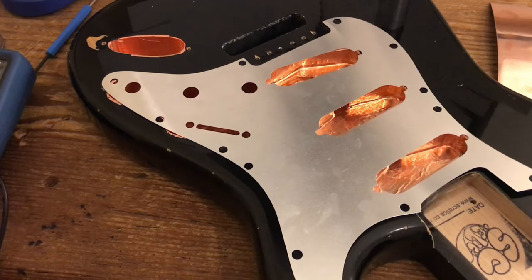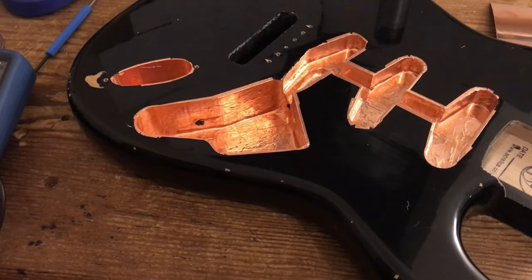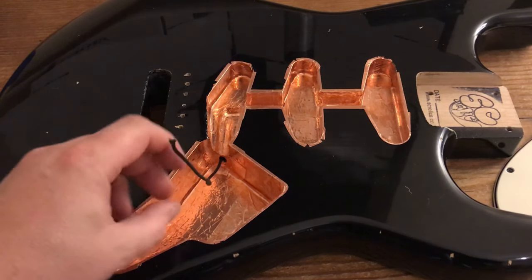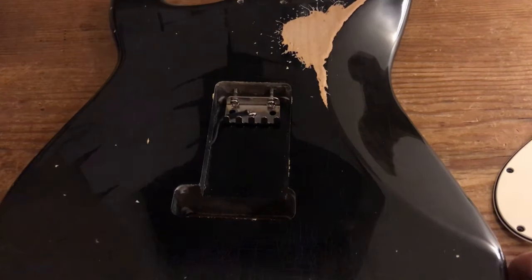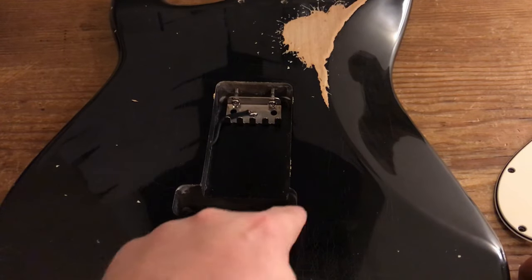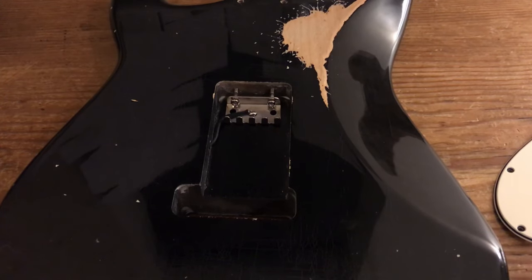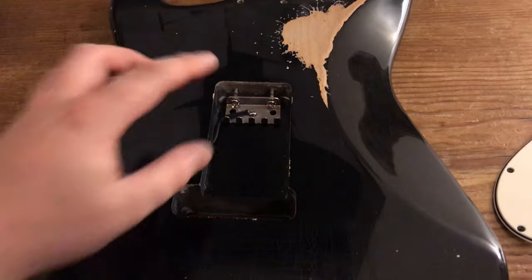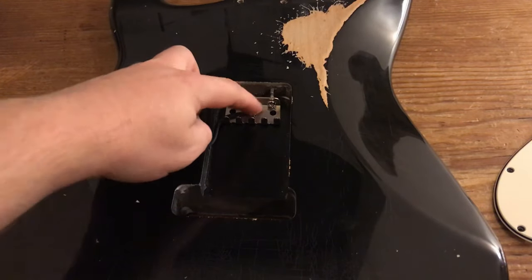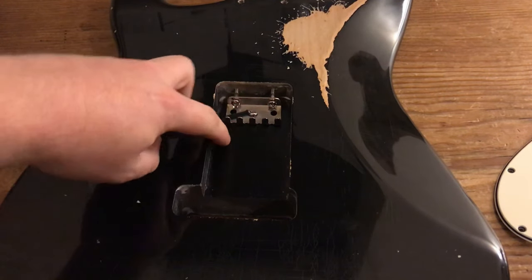That's how you create the Faraday cage. However, your Faraday cage is completely useless unless it's grounded. I've put in the ground wire coming from the trem claw on the back. When this is grounded and connected to the springs, the bridge, the trem system, and therefore the strings — which we as the player touch — that's part of the ground circuit. This is what you'll see on a lot of diagrams as 'bridge ground' or 'bridge from the tremolo' in a Strat.